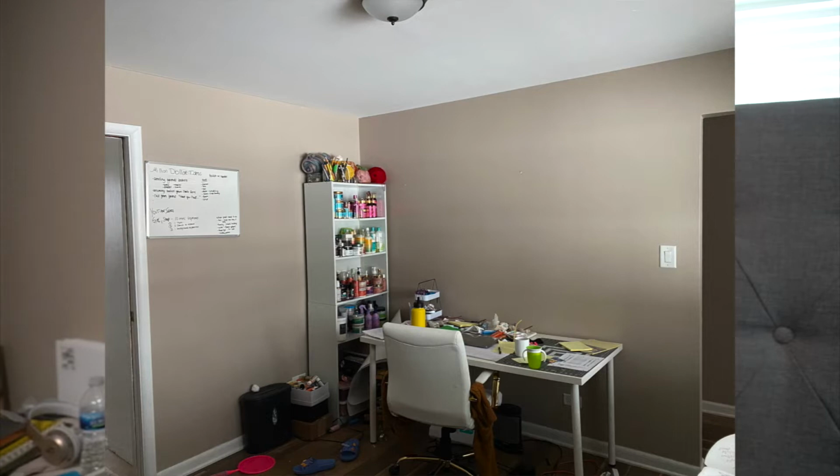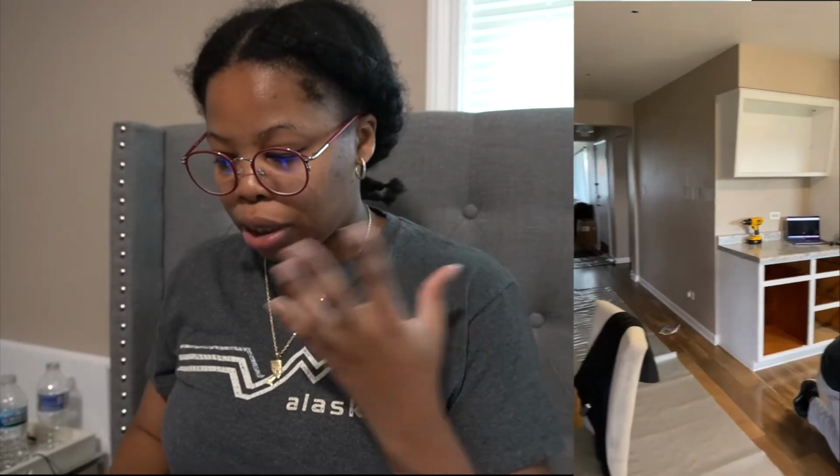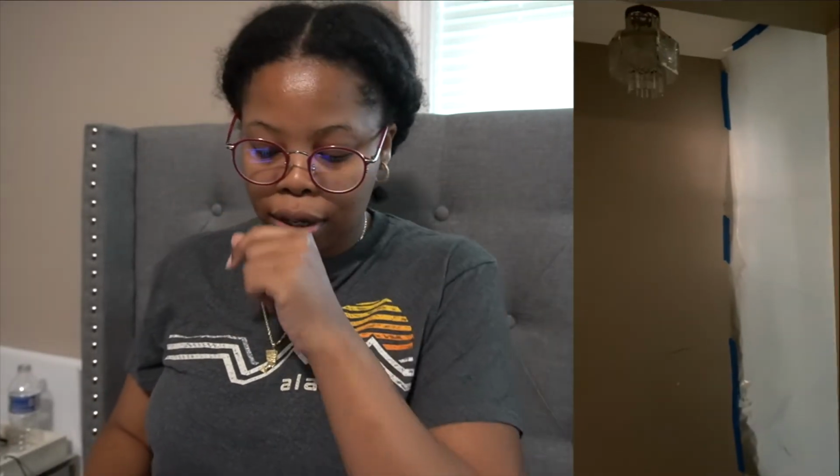This photo, same thing, different angle. We're in the process of setting up the plastic that will cover the parts that we know we're not gonna demo that day. We're also creating a plastic wall from the ceiling to the floor to contain the dust that will be coming from the two walls being knocked out. So that's what you see us doing here. Well, you see Hopeton doing it and you see me recording a few clips.